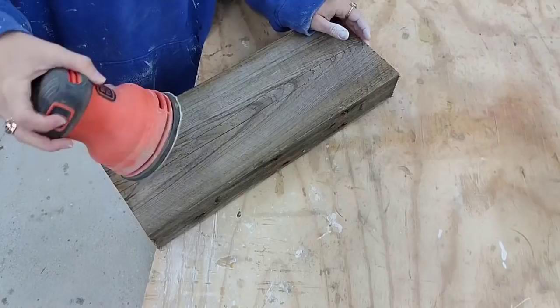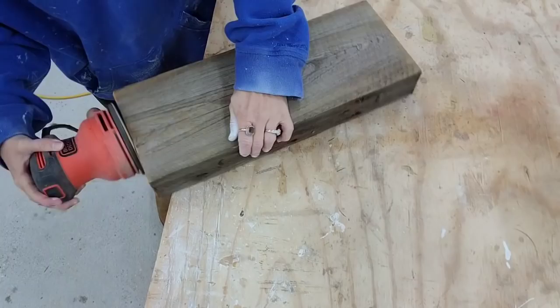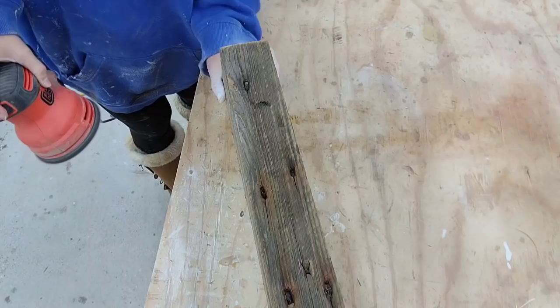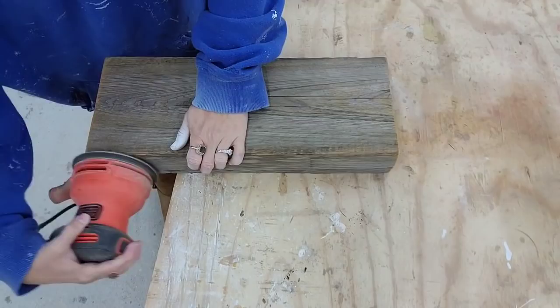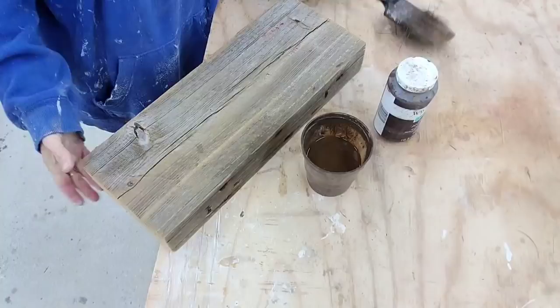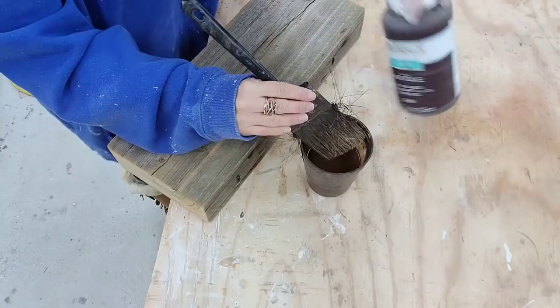She already gave me the piece of wood cut down to size. So all I want to do is lightly sand it and try to round out the edges just a tiny bit with my sander. On my other ones I round it out with my jigsaw, but this piece is way too thick. I'm just lightly sanding all the rough areas so there's no splinters, but I definitely don't want to take away the original character of this piece — we're trying to maintain that because it looks amazing. Now where it was cut, we need to blend it in with the rest of the piece because that looks brand new and the rest of the piece looks old.